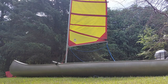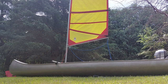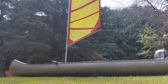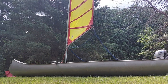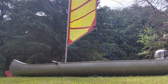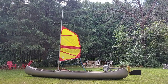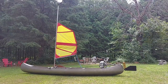Reefing is reducing sail area so you can continue to sail as the wind speed increases. When the wind speed hits about 15 knots, I put in a single reef. When the wind speed hits about 20 knots, I put in a double reef, and I can continue sailing up into the high twenties — close to 30 knots — with the double reef. It's pretty easy to do. It's a good system. With double reef you can sail in a lot of wind. It's two Fastex fasteners and two zippers to do a double reef.